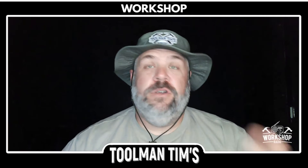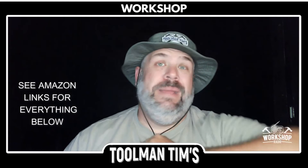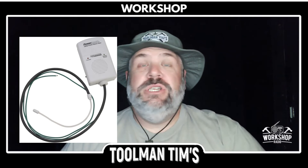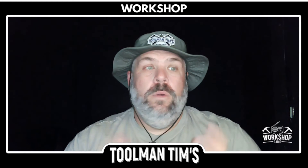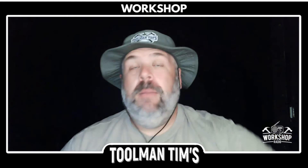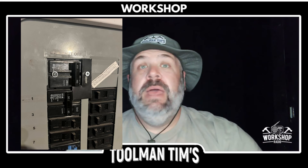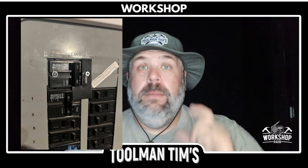I didn't know how or when the power was back on. The first time we had a power outage, I left my backup generator running two or three hours longer than I needed to because I had no way to figure out if the power had been turned back on. I've since picked up a power return alarm, which is going to get hooked up to the panel as well. And finally, I had a lock that would technically lock out the main breaker if I used it right, but you could still pull it off really hard if you tried. So I made my own interlock switch — basically flick the main breaker off, the interlock switch pops up, then the 50 amp can come over and engage the backfeeding system. There's nothing magical about an interlock switch; all it does is make sure you don't turn on the main breaker.